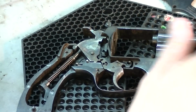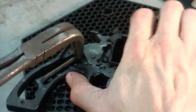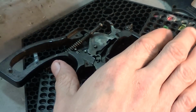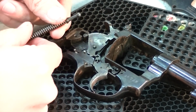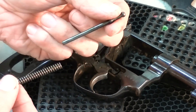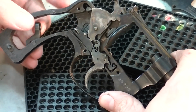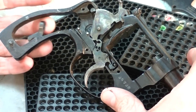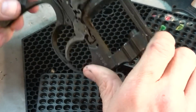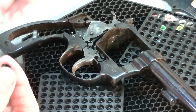And for your mainspring, maybe there's a better way of doing this, but what I am going to do is just grab a hold of it with some pliers, and I grabbed it right up here and pulled down. And there you go. That right there is a separate piece. Doesn't have to come out, unless it was cracked or broken. We'll know about that after it comes out of the ultrasonic. A lot of times the ultrasonic cleaner will really make stuff like that show up.